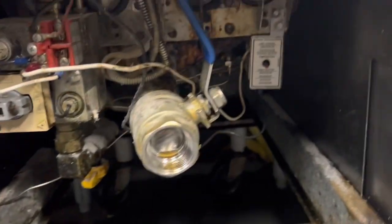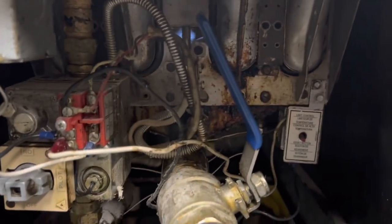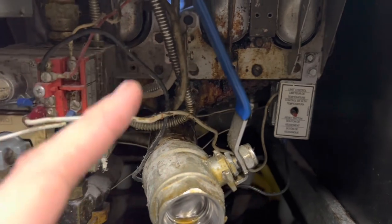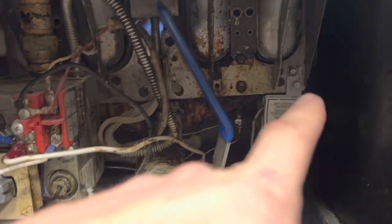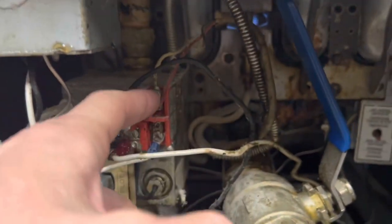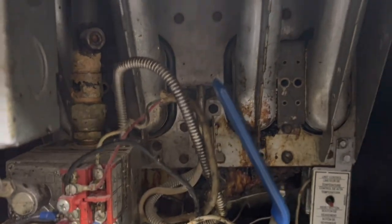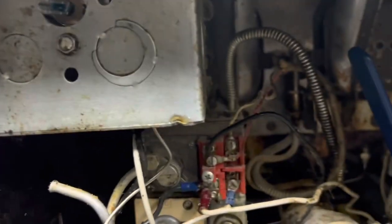Pitco fryer, they're saying that they keep finding it turned off. The oil's not overheating, so it's not shutting off on an appropriate high limit. But they're finding it with the pilot out. Oh, there it goes. Look. So there's only one thing that would turn the pilot out. Well, there's two things that would turn the pilot out.